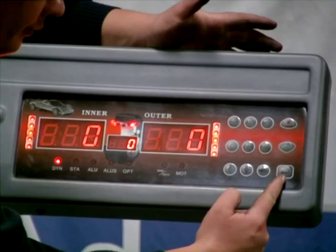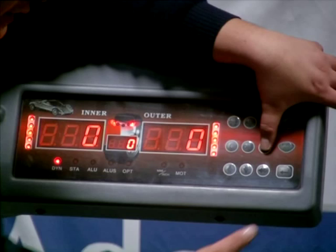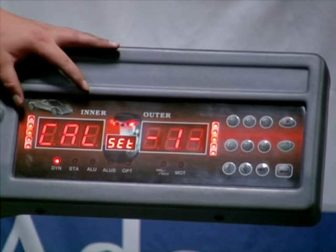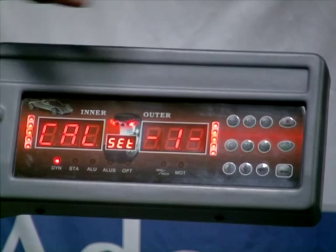What you'll need to do: first push fine once, then hold fine in and hold the enter button in for about 5 seconds. Release fine, keep the enter button in. In your inner it will say C-A-L, in the centre it will say set, on your outer it will say negative 1 — 100%. Then push the enter button. The inner is saying C-A-L, your centre is add, and on your outer it's showing you zero.